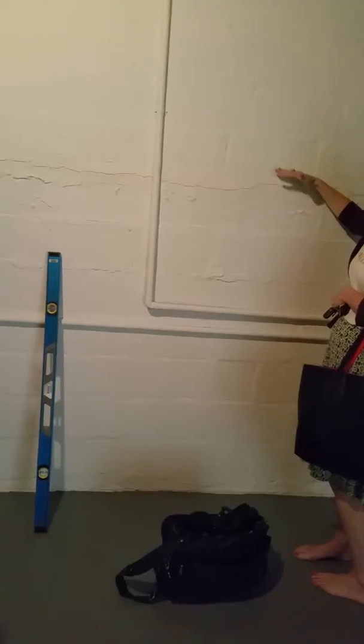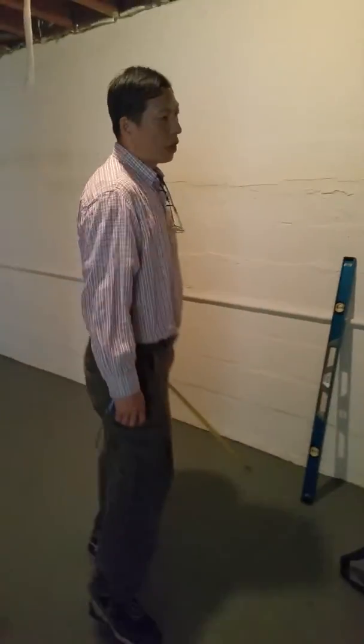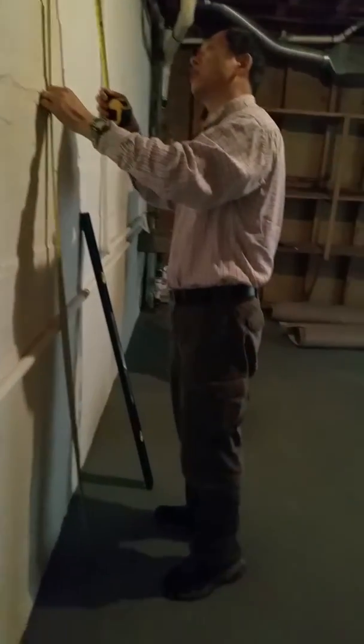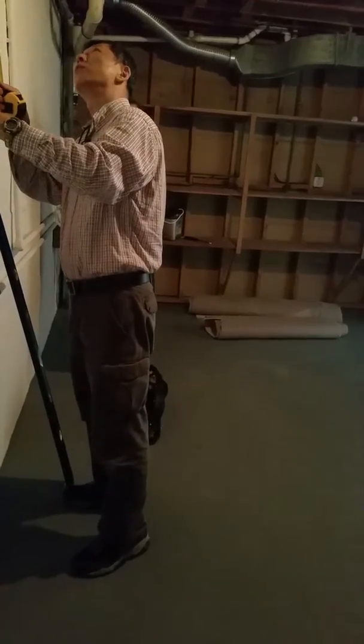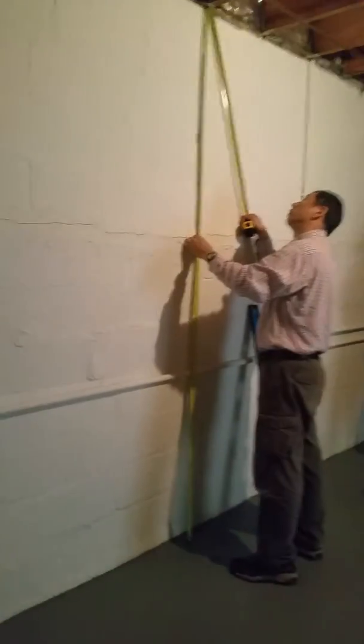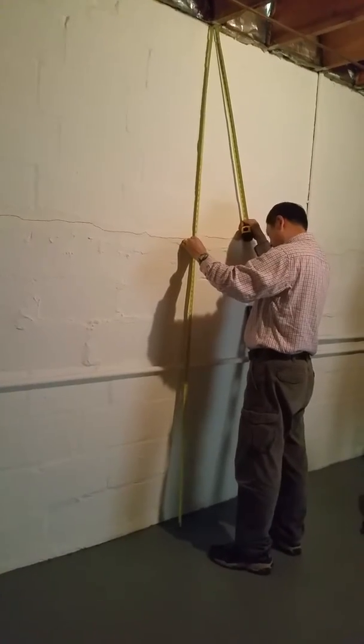Looking at the staircase, how far below grade are we here? From here going down to the front, it all appears level and about the same — around 100 inches below grade. To the top of the wall, we have about eight feet, five inches. That's a little tall. If that is the situation, he might not need to reinforce the wall — just drainage. But we do need the reinforcing as well.